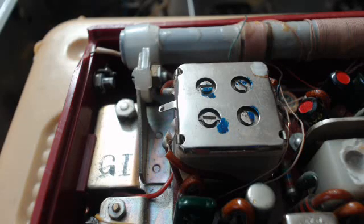Now we know on the tube ones, if someone dropped something into the radio, which they used to do in the old days, they would bend the plates. And if it was an All-American 5 radio, that was one of the things that got messed up. People would go in and play make-believe. So you straighten the plates out so they didn't touch. And then you had to fix the speaker because little kids while eating breakfast would stick the fork into the speaker. Volume controls would go bad. And then the filter capacitor on radios. I used to pull them out of the garbage, and every one of them needed a filter cap. So you put a filter cap in, now you find out the volume control is bad, or the speaker has gotten a fork through it.